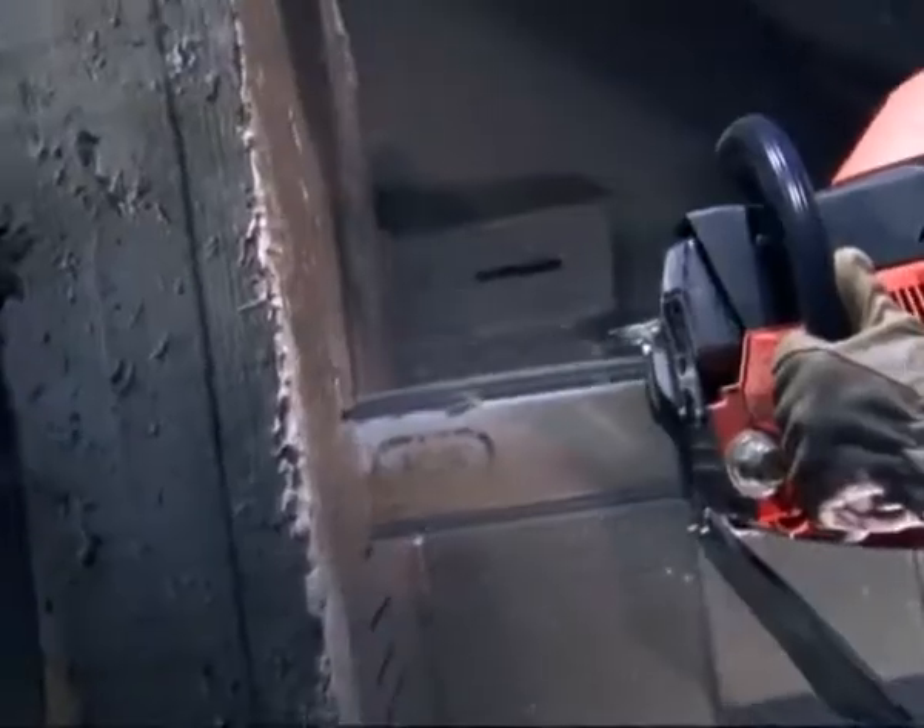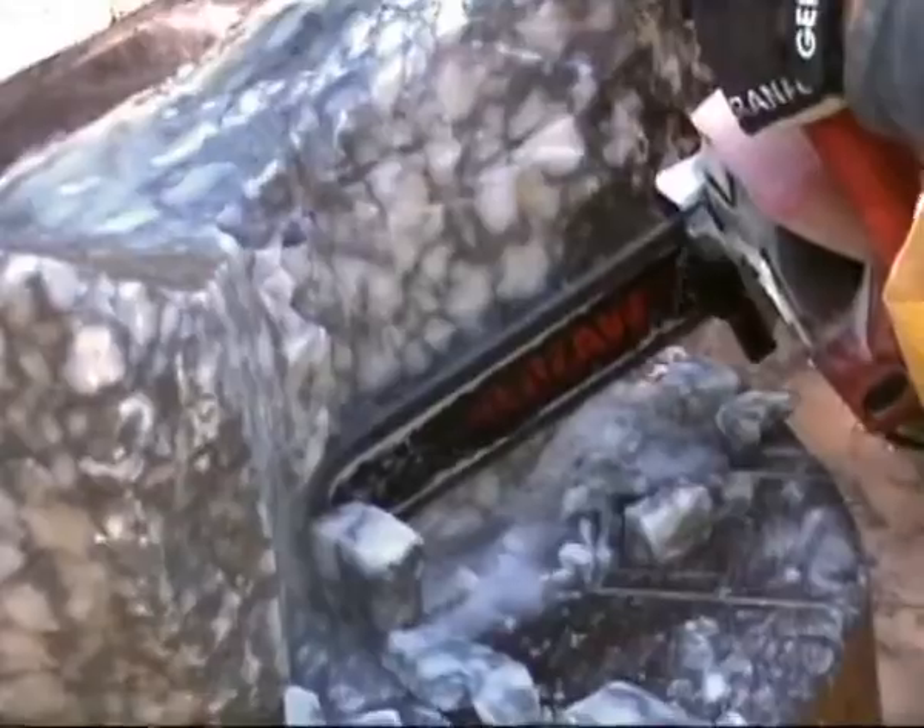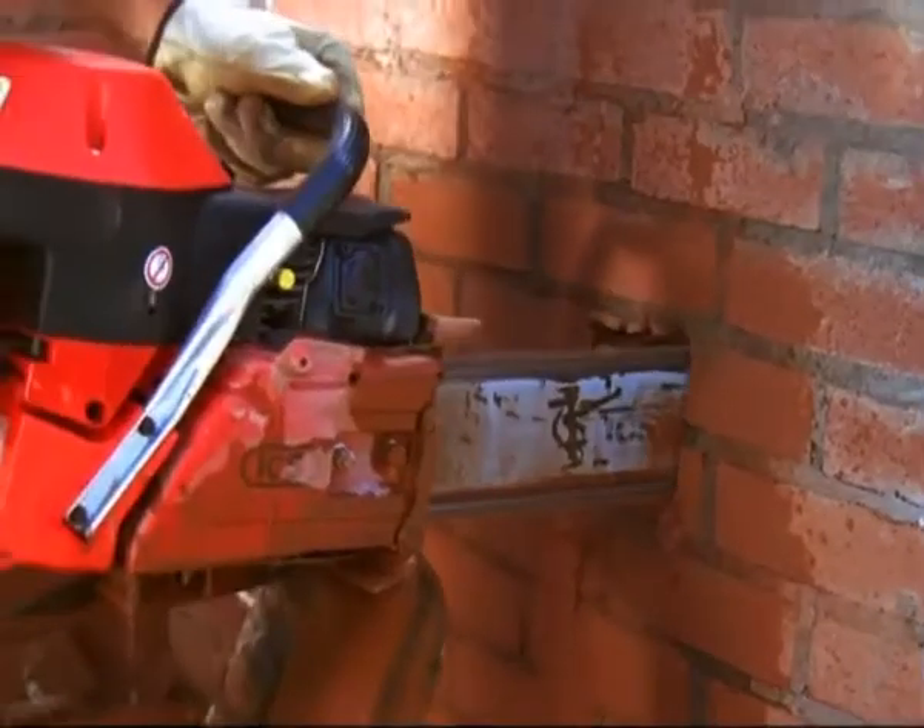You have all the options — the ability to plunge directly into concrete, brick, stone, abrasive materials like limestone, small openings, square corners, no overcuts. It's a straight bar edge, it's not a circular saw. You don't get the overcut; you get the true square corner.